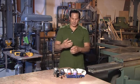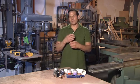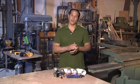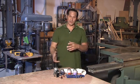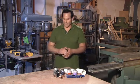If you're using galvanized pipes, which is very typical, you want to try to loosen it up, and it'll give you a hard time because they also fuse together, but for a different reason. It forms a rust in between, and it's very hard. A little elbow grease, maybe a little heat, and some penetrating oil. And be careful because the penetrating oil is highly combustible, so you want to make sure you don't use them in tandem with one another. Back off the torch and then add the heat.